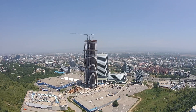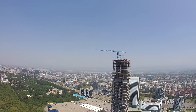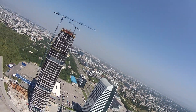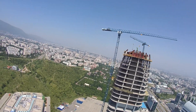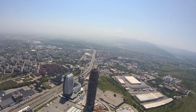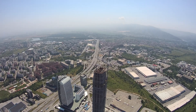Of course I'm not going to leave it like this. I will print out a longer standoff, which would also be better designed for the motor mounting, and continue with the tests to see if we can get anything more discernible as far as results go. I may also look into installing a more powerful motor, so I can put more weight at the back and be able to use a lithium ion battery at some point, although the lithium polymer seems quite nice for these tests since I don't have to wait an hour to see results, it has a higher C rating so you can really push it without it sagging too bad, and it is light enough to have a good vertical even with this motor.